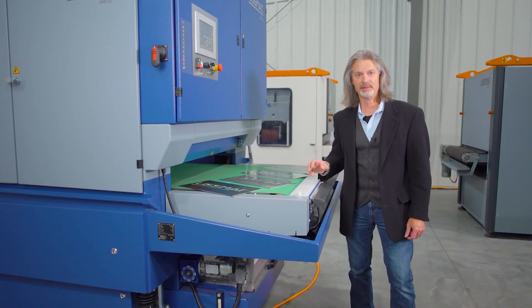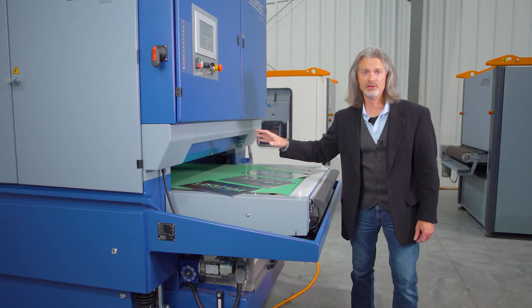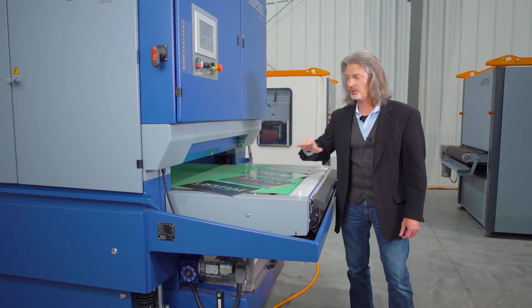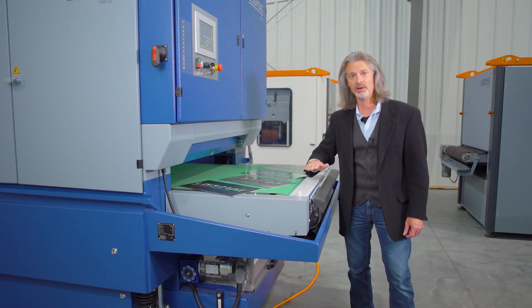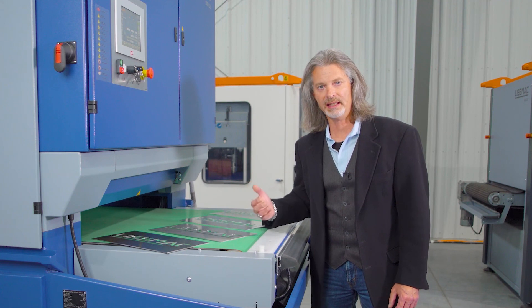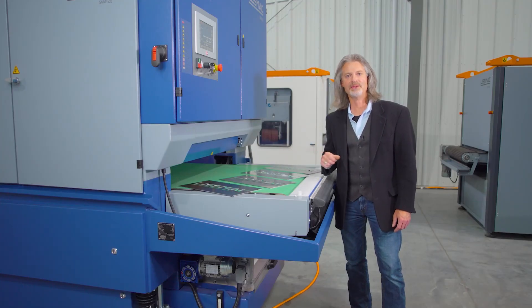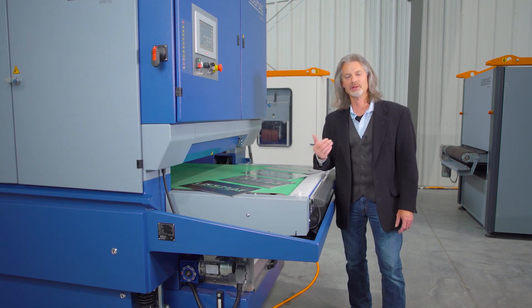This is the most versatile machine that Lismac builds. We can swap the brushes — if you have a barrel brush in one shift, you can put a top brush into that same head the next shift. You can mix materials, from laminated pre-finished stainless steel and galvanized parts that you deburr without removing the coating or zinc, all the way through to plate material where you want to remove a lot of stock. You can use it as a dedicated deburring machine or as a surface finishing and deburring machine. It's a terrific, versatile, high-quality machine — a 24-hour-a-day, seven-day-a-week machine. If you have any questions about it, we look forward to hearing from you.